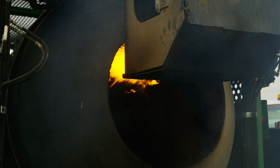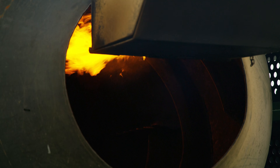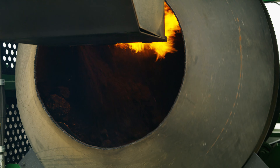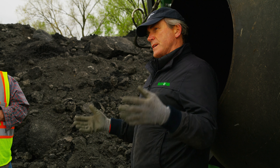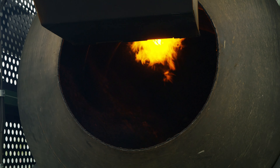We have a direct flame and cascading mix on the side. In terms of the mixing, we designed flighting that accomplished that, and a drum rotation of anywhere from one to nine RPM to keep the mixing going.